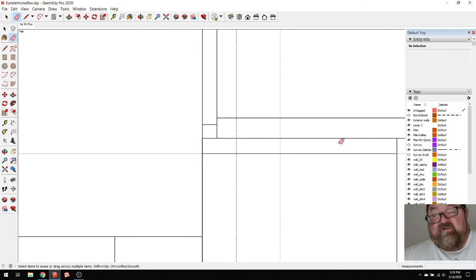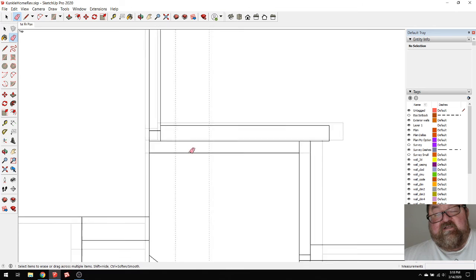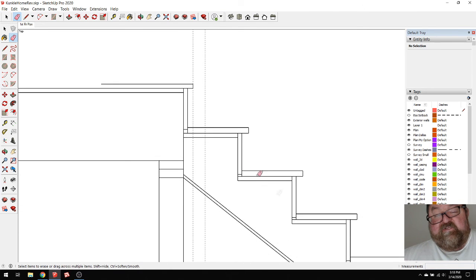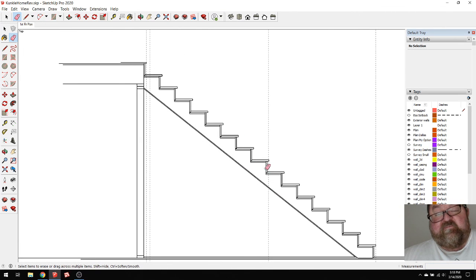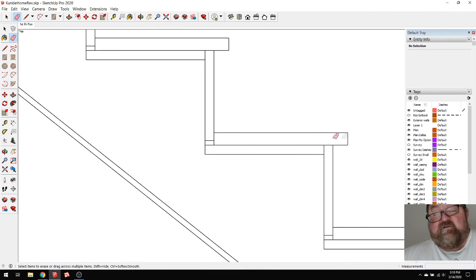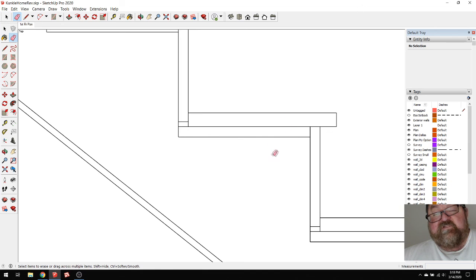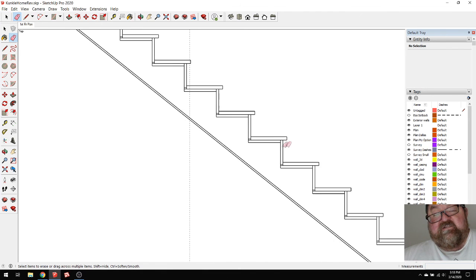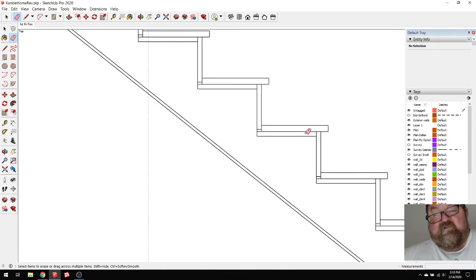He forgets I like this 3/4 inch Advantech permanent. You see, I had designed that in permanently because it's safer to have that Advantech on these stairs while you're building. It's like having a subfloor on your steps, and it makes them real strong. When you go back and put this finished tread on here, you can just screw into this and you can glue it down if you want to. We usually use silicone. I usually don't glue mine down because I don't like them permanently affixed. Silicone will also make them quieter. They won't squeak as much.